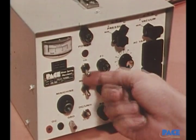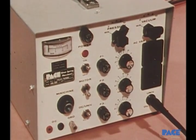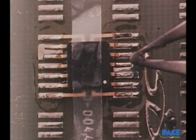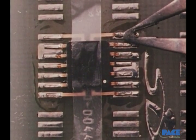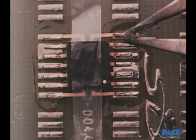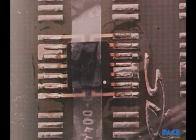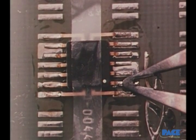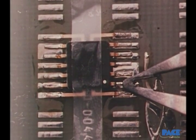Like the thermal wire stripper we saw earlier, the lap flow tool is plugged into a power supply, and its heating is controlled by the foot switch. In use, the tip is placed on the lead and the foot switch depressed to instantly heat the tip. When the solder flows, the tip is slid towards the middle of the lead and the foot switch released. Then for a moment, the tip is held motionless with light pressure on the lead until the solder has cooled, and then removed without disturbing the joint. The big advantage of the lap flow tool is that the tip holds the lead clamped in position throughout the whole operation — put on cold to clamp the lead down before soldering, and then holds there during both heating and cooling.